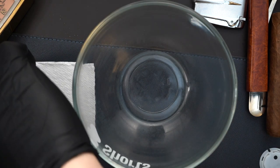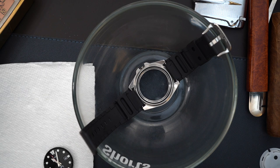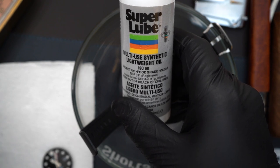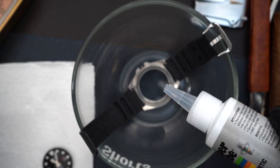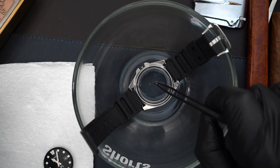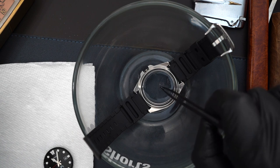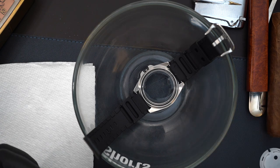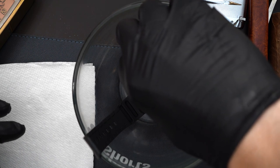Here's the bowl, and I'm going to place the watch in it — this is obviously the case without the crown. I'm going to fill this with oil. The oil I'm using is Super Lube — this is multi-use synthetic lightweight oil, ISO 68. It's food grade, so you could technically eat it, but I would not. I'm just going to fill up the case right away. I have plastic tweezers to pop any bubbles or move them out so there are no bubbles when I place the movement back in. I'll just drop this in.